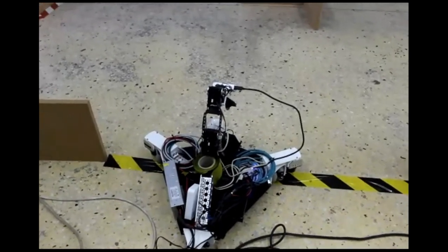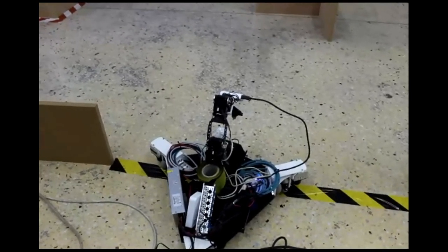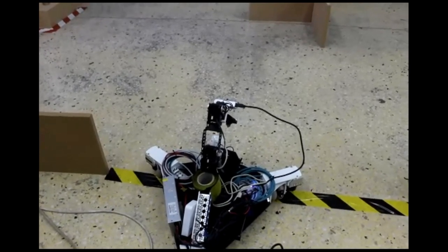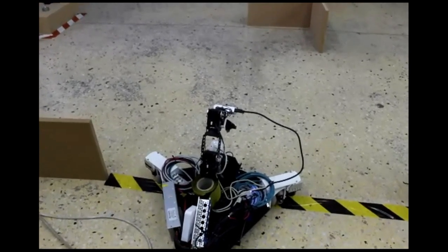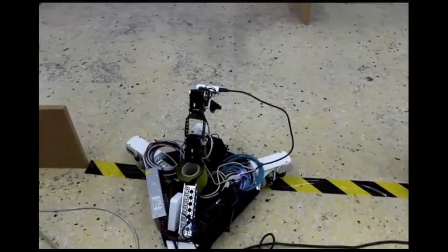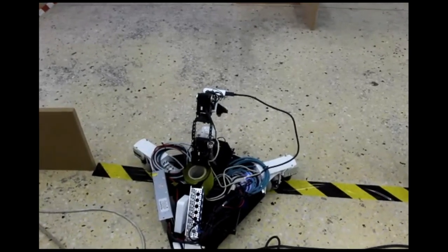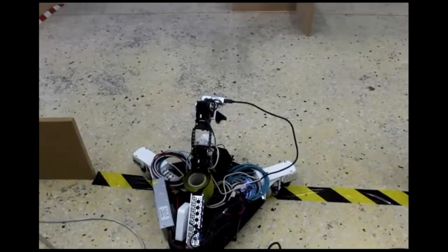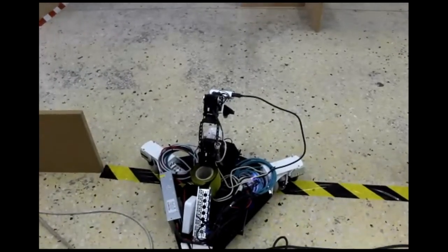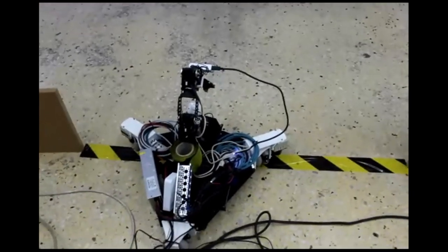There's already a laser scanner assembled in the front part, isn't it? We use two LiDAR sensors, in front of the two wheels. That's a major part in the whole design, because due to the field of view it has, it minimizes the blind spots we have. There's just a really small blind spot in the back top, and really close to the robot in front.